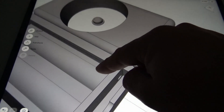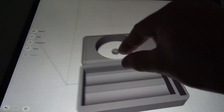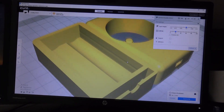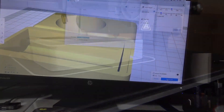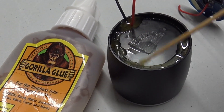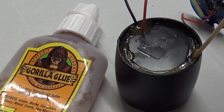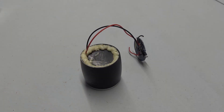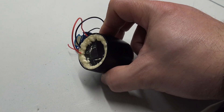I made a push button that will go in the hole. As you'll find out in a minute, none of this worked properly — it sort of worked after a fashion. The plan is to go ahead and print that up on the 3D printer. In the meantime, whilst the printer's doing its thing, I went ahead and put one of those plastic screens back in place in order to seal up that speaker enclosure, and then I put a shed load of Gorilla Glue in there. Hopefully that means the speaker enclosure will have a similar cavity size to before, so it should be tuned in a similar fashion.